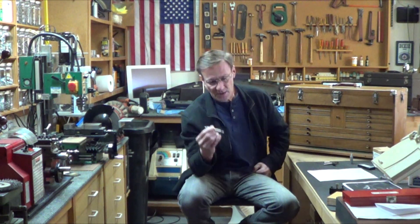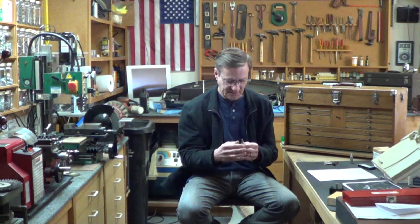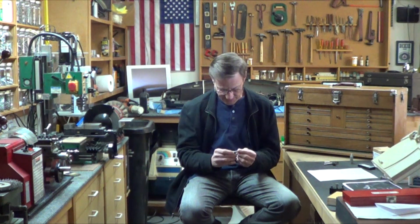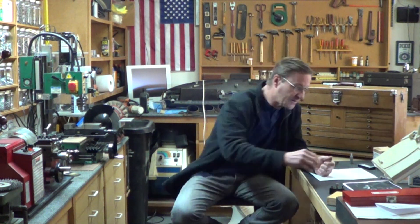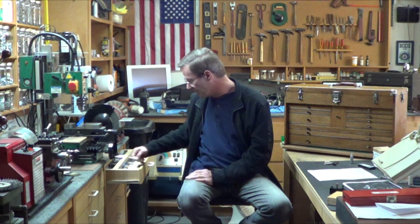First things first — I had mentioned in a previous video not to put oil in your edge finder. This is a Mitutoyo, and I did put oil in it. This side snapped and it's still screwed up. I put it back in the mill, tried alcohol and everything to clean it up and nothing worked. So Santa did bring me a new edge finder — this is a Brown & Sharp, really nice. The only difference is I wanted one without the point on the end. There's a screw and I think you can adjust tension with it. It came from Amazon, thirteen dollars. I'll probably use the old one for situations where I don't really care about accuracy.